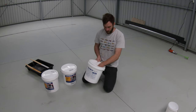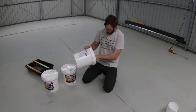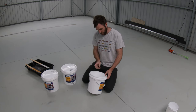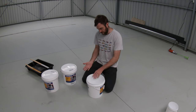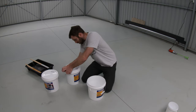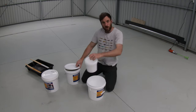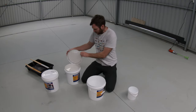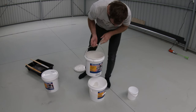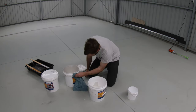How I was going to do that — I've got markings inside the bucket. That bucket is virtually cylindrical; the bottom part is slightly narrower than the top, but not by much. So I've just got 10 centimetre markings on the inside: first 10 centimetres of Part A, and second 10 centimetres of Part B. The second probably only needs to be about nine and a half centimetres to actually make it evenly 50-50, because there's slightly less volume in the bottom half of the bucket. That was a pretty good pour. I've previously already mixed these up, and you can see the sticks I've used to make sure it's already mixed sufficiently.